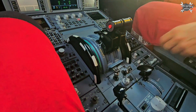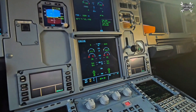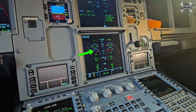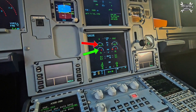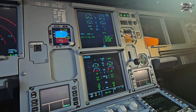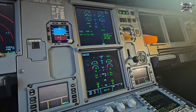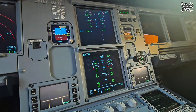During run-up, as always, we need to monitor all parameters — but especially oil quantity and oil pressure since I worked on the oil system. Oil pressure is slowly raising and oil quantity is slowly dropping. The reason is that the oil pump, which is part of the lubrication unit and installed on the accessory gearbox, starts to work. That gearbox is currently driven by the starter and will later be driven by the engine itself. Thanks to that, oil is distributed between all components, and whenever we reach idle the oil quantity should stabilize.